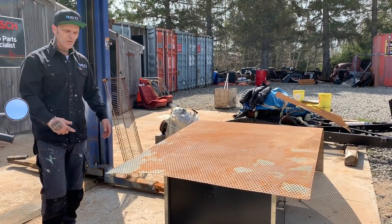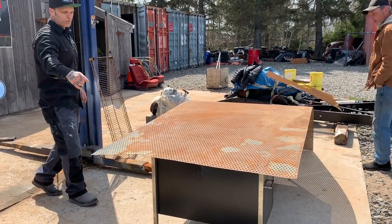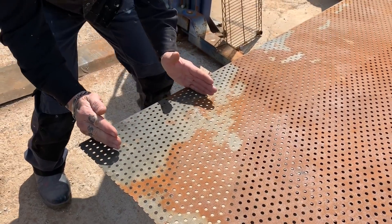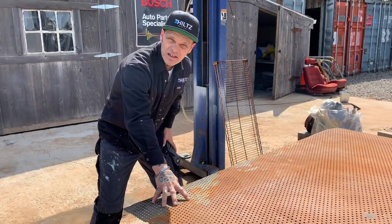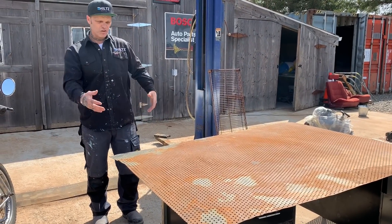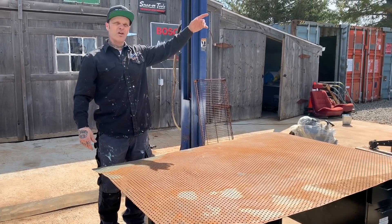We'll shut her down, we won't make them right now. We'll have to go and get a zip cut and measure it and all that sort of stuff. But that's the metal right there that we're going to make the light fixtures of. What we'll do is once we get one made, I'm just going to bend it up here three inches, mark over nine, and bend it up here three inches. Cap it on the end and slide it up over the light. I'm going to french the light — make a box for the light to go into — and just screw it on either end. We'll hold it up to make it look right, and you won't be able to see the old light up there. And if you do, it'll look old like we want it to. Then we'll show the video of us putting it on and what it's going to look like.